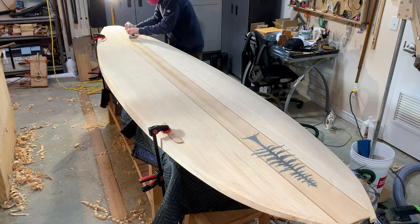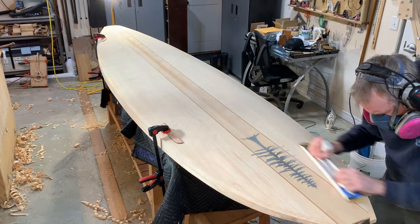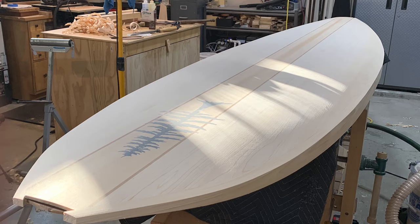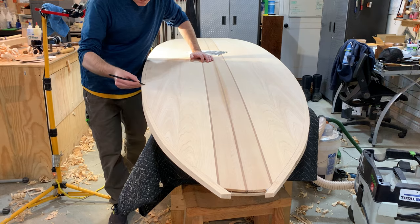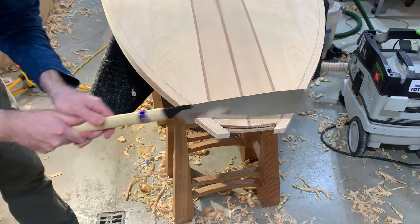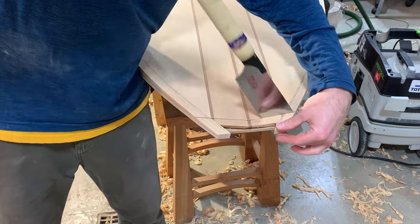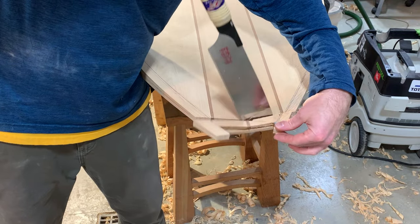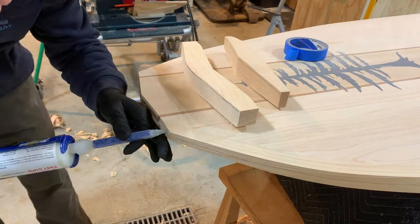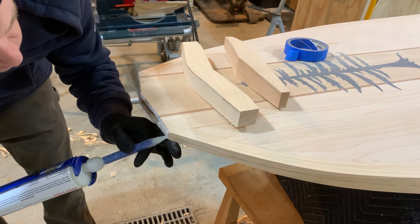Then you can fair that down. I'm using a Hutchins Speedfile longboard to bring that surface all together into one cohesive shape. You can lay out your rails — I've done that — and I laid out the nose and tail block. Decided it was time to fit them because they're going to get shaped as well. Thixo again. Right out the tube, so easy. No mess, no mixing.